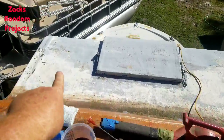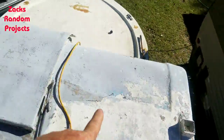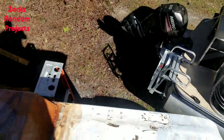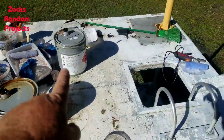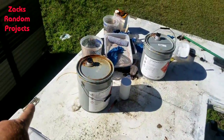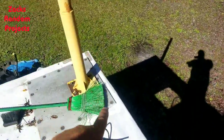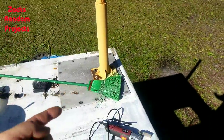My goals for today: get this front deck sanded and smooth, take off that old remnant of the railing, pull out broken-off screws, and fill all the screw holes with caulking. Anywhere there's a screw hole, it's getting caulking. I'm gonna clean all the garbage and stuff that's accumulated from me working up here off the back deck, fill any little screw holes, sand the back deck, take the remnants of that crane off the back, and hopefully get that big giant aluminum plate off the top.